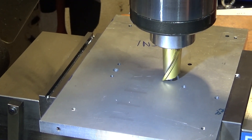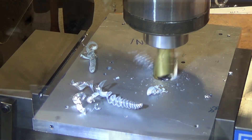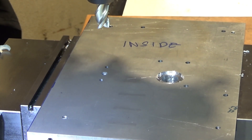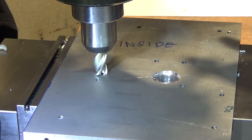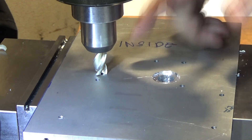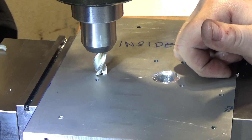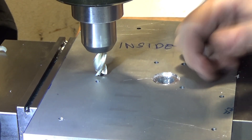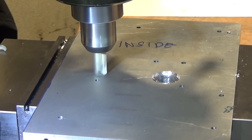We're on the second one. We're going to do the pocket for the shaft. Hopefully I'll catch the pocket for you this time. The way I set my Z depth is I start with the quill touching, lock the quill off, set my Z zero, and then always come up a little bit so the cutter is not engaging. We pop this up and we're going to go in two hundred thousandths.